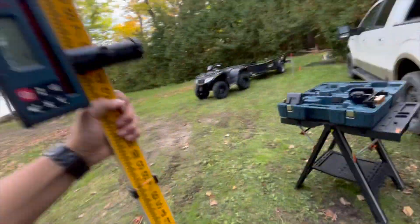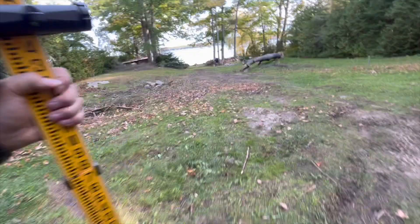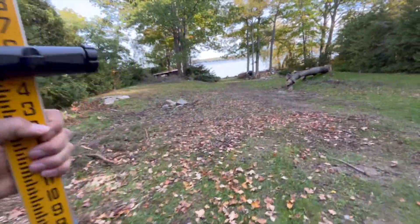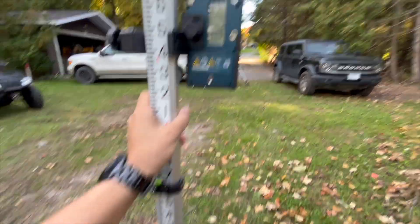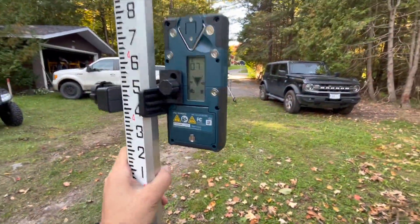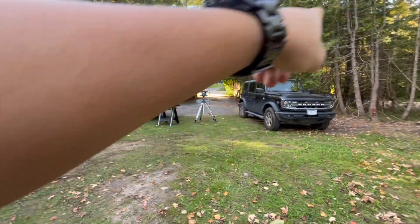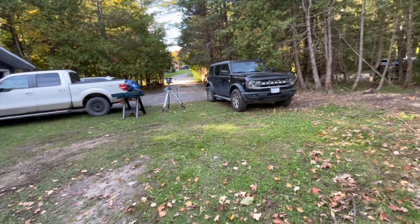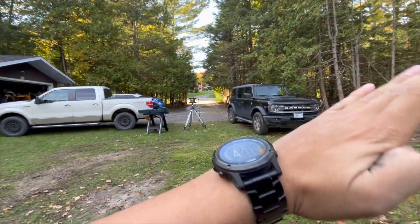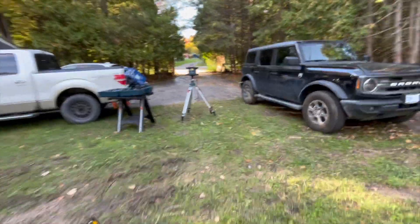If we take the grade stick right here — that's perfect because it's green. Then when we come back down over here you can see that's 2% slope — that space under the bar. So if we had the Y slope set as well, we could get our grade slope both this way and this way at the same time. That's the cool part about this laser — most lasers would only do one slope.